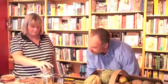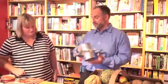To the venting. Well, for two reasons. If you're using an electrically cooled cellar, you need some sort of cooling unit that has access to the outside. And then you also need to vent your space, because as I said, the vegetables are giving off a lot of moisture. They're still transpiring because they're still alive. So you have to vent that off and admit fresh air in a certain ratio. You want enough venting to control temperature and humidity, depending on the season and size.